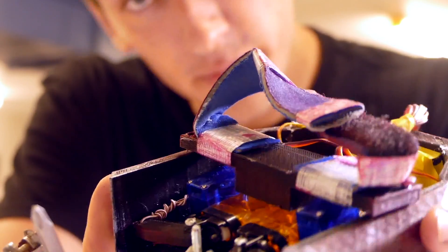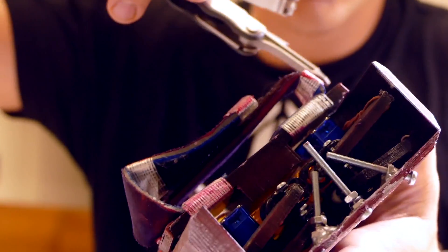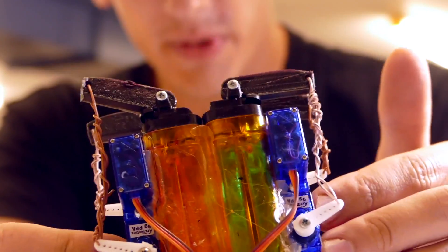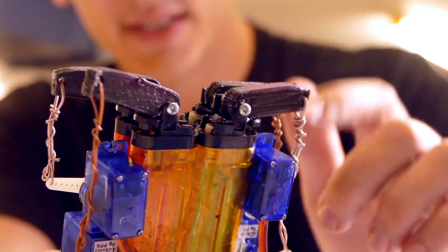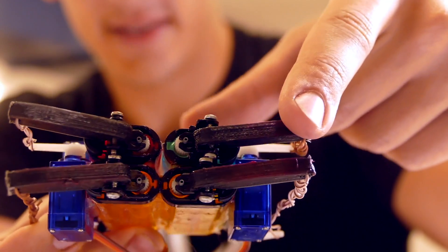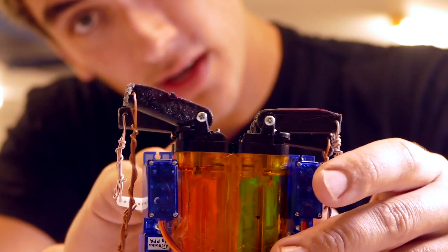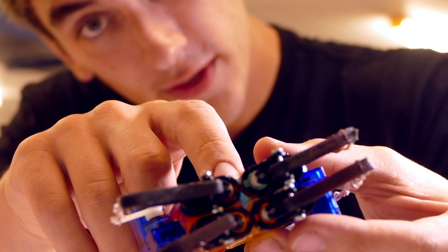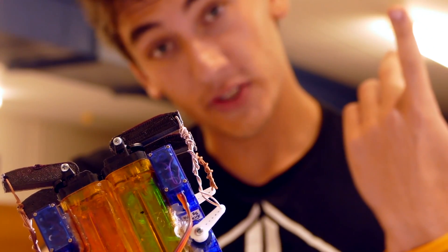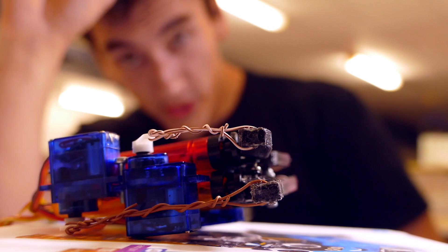A little arc goes across. To refill this, it's a little bit of a hassle — if I was going to do an upgrade, I'd probably change this. To load it, we've got some screws on either side that hold the bottom piece on, so we just take these off and we have access to the main brick. This is where all the mechanical stuff happens. We've got four servos attached to four lighters. These 3D printed little bits screwed into the lighters — when the servo pulls them down, they decompress and shoot out whatever is inside the lighters. The four servos are controlled by the four buttons on the palm. Whenever you press down a button, one of these servos will go down and the corresponding light will turn on as well. So let's say we have some green fire in the solution — press the first button, green fire would come out and the green light would go on, kind of like how it happens in the movies. We've got full control over which thing we want to shoot when.